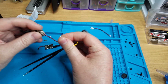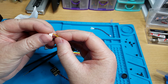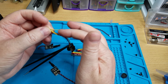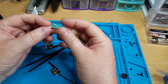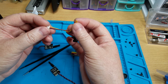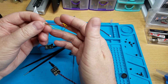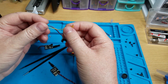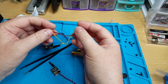It looks kind of funky because it comes with this four-pin plug and comes with one plugged into one of these holes. It's the video attaching itself to itself — it's really weird. I have no idea why it would be in there as one of the pins, but I pulled it out and left it connected because you have to have them connected, and it still works. I'm just gonna trim it off and then I've got my video in/video out for my OSD, but for now I'll leave it connected to show you.